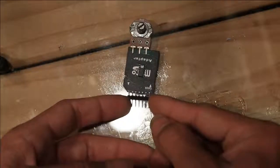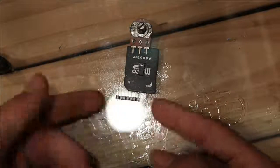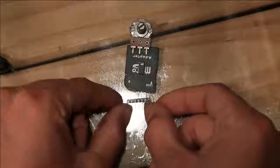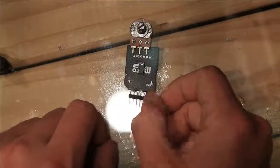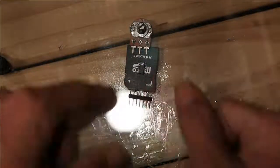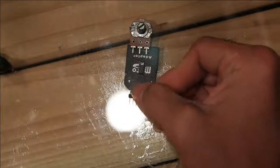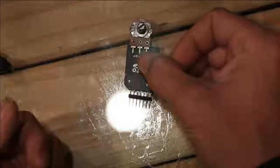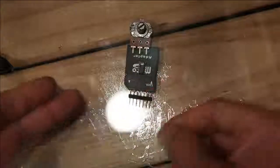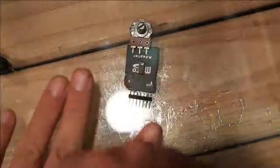Of course, I wouldn't be putting a pin header right here, but it'd have the same footprint as if you would. So it's got the 2.54 millimeter pitch of the holes. Although I might have a few here and then a gap, and then one for the power supply, because for the board, if we're counting the LED, you've got the input to the board, output to the board, common to the board, which is actually the negative supply. So that's just two or three if you want to put an extra link there.